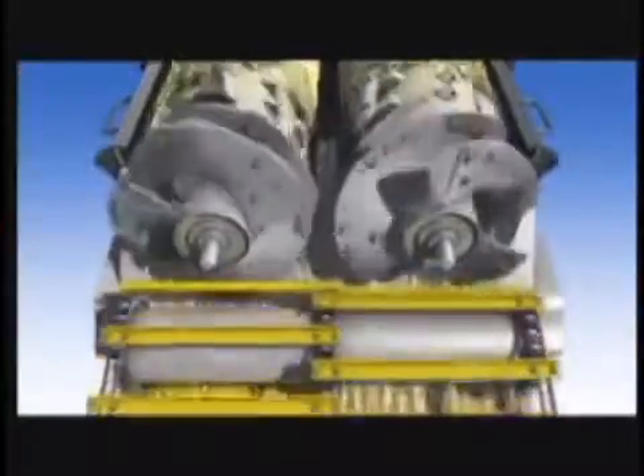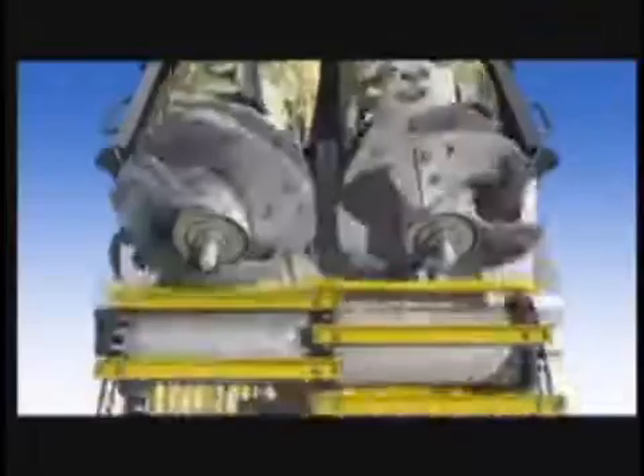Now to threshing. When divided into two streams, the combine's crop mat becomes wider, producing a thinner mat. A thinner mat is much easier to thresh, as each rotor has less material to process. The CR's S-cubed rotors incorporate segmented, spiraled, and staggered rasp bars, which begin the threshing action. As there are only two individual threshing areas with two adjustable concave areas, the crop mat is spread evenly and is gently and very efficiently threshed.